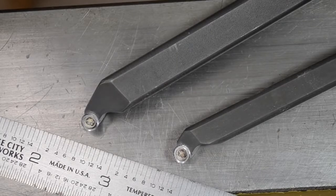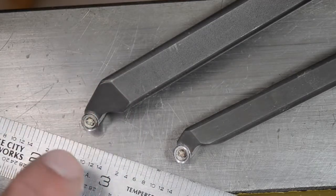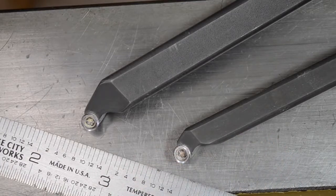Good morning. I thought I would try to do a little demonstration of the new Hunter Viceroy tools. The Viceroy tools are a fairly new one on the market. The larger cutter is a half inch shaft with a six millimeter cutter. The smaller one is a three-eighths inch shaft with a six millimeter cutter. I find they'll cut pretty aggressively with that small cutter, but also the small cutter tends to leave a better finish. So let me get a piece of wood mounted and I'll start playing.